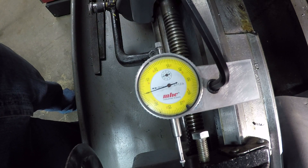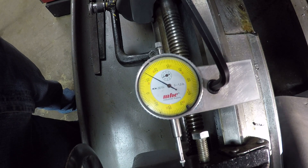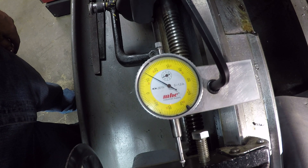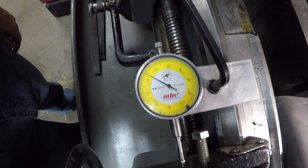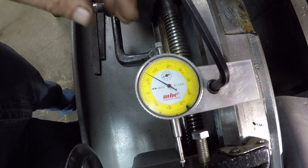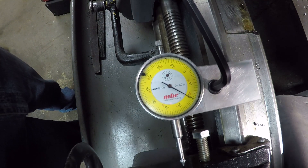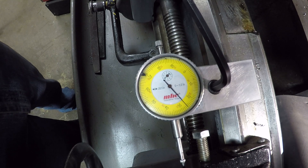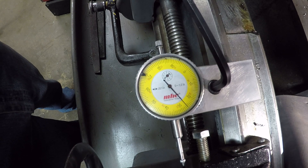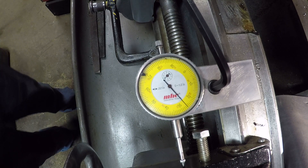Now DA — put it on zero, one revolution — and that is almost fourteen thousandths, thirteen and a half. Now I'll do CA: one revolution, and that goes twenty-six thousandths per rev. So the CA setting is about twenty-six thousandths.